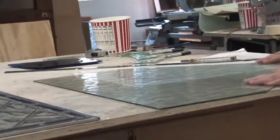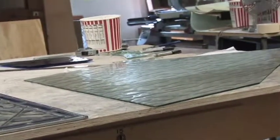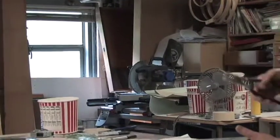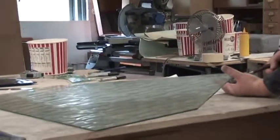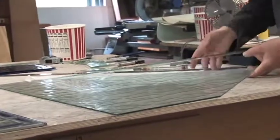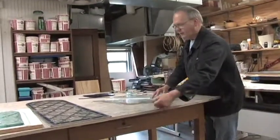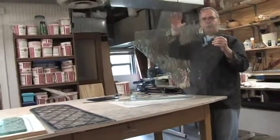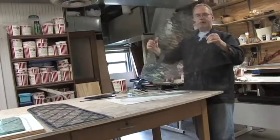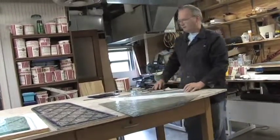Now I've scored that long strip across the top. What I'm going to use is what's called running pliers — they've been around probably 30 years now. It's actually curved, and when you squeeze the pliers it creates a nice motion that breaks the glass nice and straight, so I get that nice straight line. Also, notice with this piece of glass there's definitely a pattern that goes up and down. So when I'm cutting this glass, each piece is going to have to be oriented up and down — I'm not going to turn a piece sideways because it's going to obviously show. I keep this strip straight up and down.